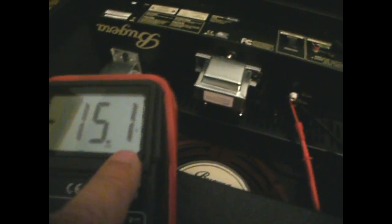You can see now we're probably a few minutes into the warm-up cycle. They recommend keeping it warmed up for about 10 minutes before really doing any adjusting, so you're seeing a little bit of a rise. One of the precautions they mention regarding biasing is to do very small changes in the bias control — it's right underneath the jack there, a tiny control. Do it very slowly as far as adjusting.